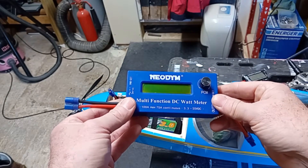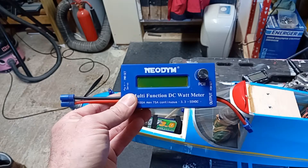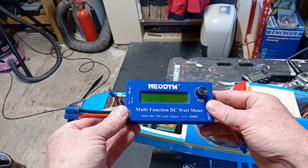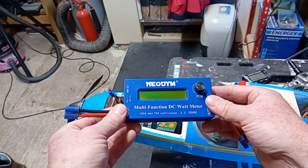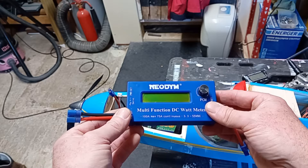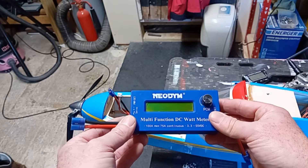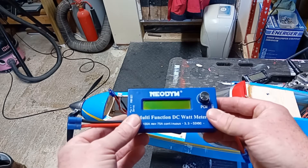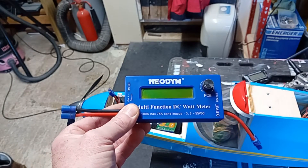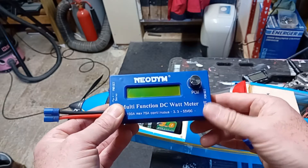It's a very safe way of determining an electric powertrain setup. If you're a beginner in the hobby you won't be using wattmeters yet, but as you get more into the hobby and want to experiment with various brushless motor and lithium polymer battery setups, prop sizes particularly - because changing a propeller on an electric motor drastically affects how much current the speed controller draws. The danger is you put too big a prop on, the speed controller works too hard, draws too much current, and burns out.